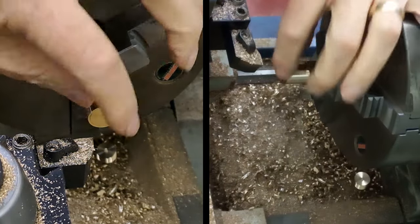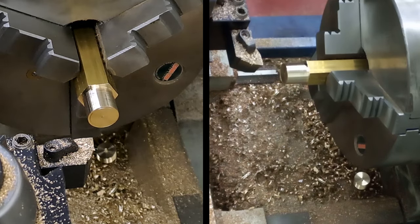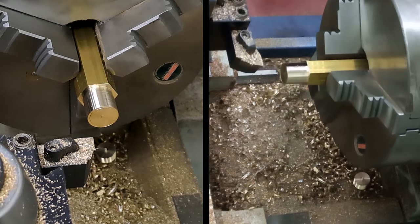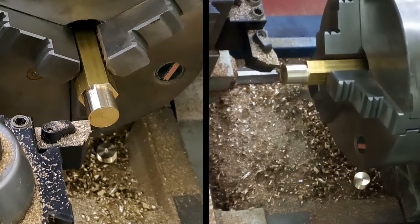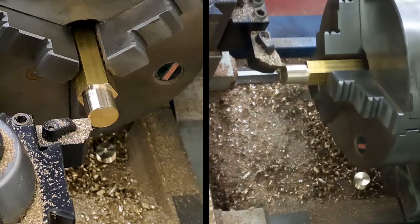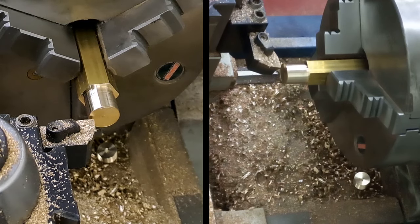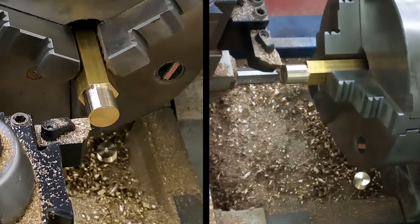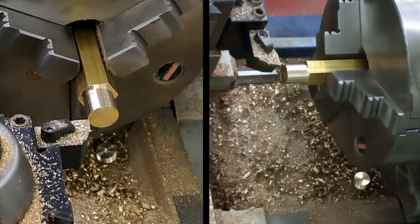So we're now going to take the next 4 mil down to 12.7. That's one full turn on the dial. And what did I say there? 4 mil is 173 divisions this time. So let's do this one. I'll just check the zero again. We have contact. So there we go, just reset the zeros just to make sure we're good. Yep, I think we were at that, weren't we? There we go. Yep. Right, here we go, 4 millimeters down to 12.7.